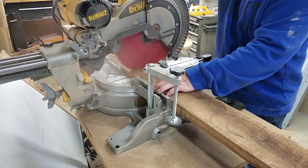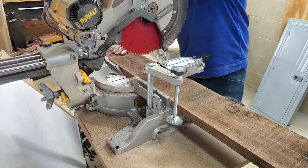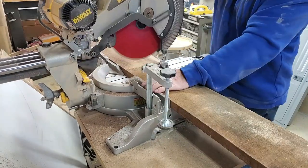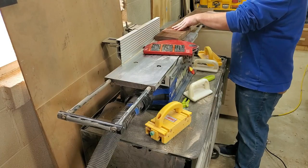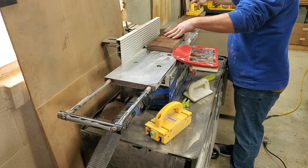I'm going to kick this project off with chopping up and milling down some walnut lumber. I'm using some one-inch thick walnut, but the plan is to mill it down and glue them together three pieces at a time to get this gate to be about two and a half to two and three-quarters inches thick.